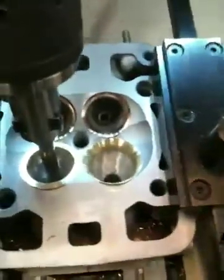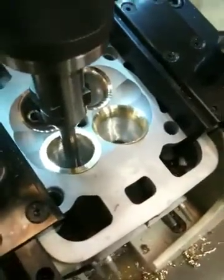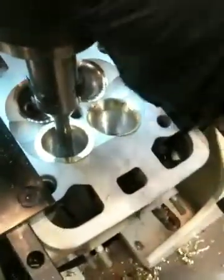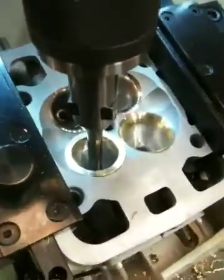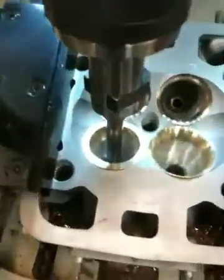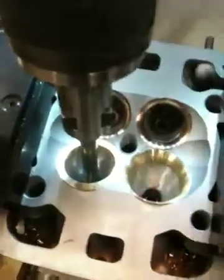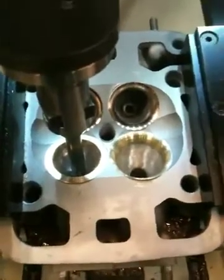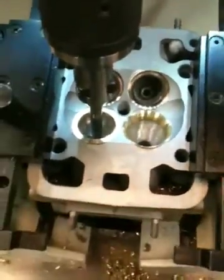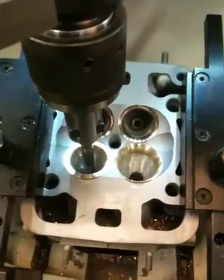I showed you the full radius cutter, but I won't show you the intake cutter because that's top secret. I keep rotating this head so you can't see the cutter. We're going to rough out this next seat, get it close, and show you the intake seats getting cut — and that'll finish us up for the 996 head beryllium bronze intake seats with oversized stainless steel valves.